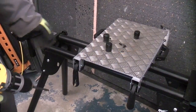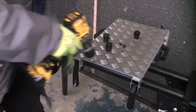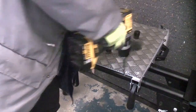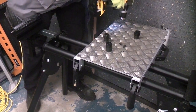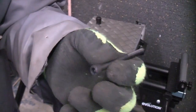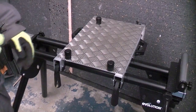I'm just going to open the holes up to 7mm. To fix the machine back down I'm going to use some bolts I've got lying around — these are M6 x 65mm long socket head. I'll put the three feet where they need to go and now I'm going to put the saw back in position.